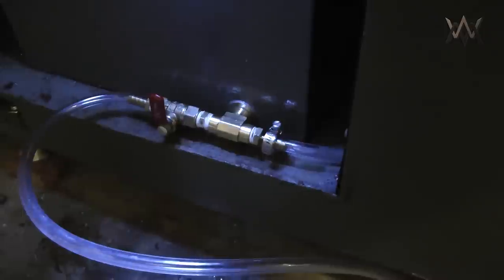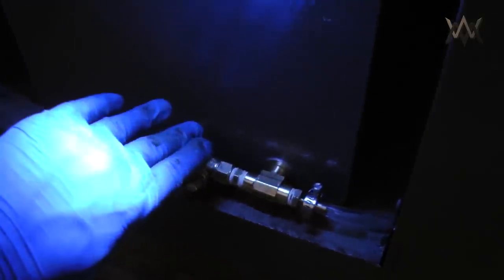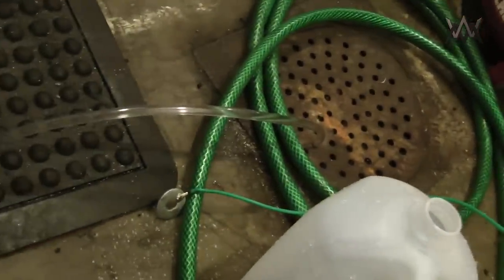I also installed that bar going across the chip tray just to help hold it better, and also kind of serve as a handle. So here it is after I got everything cleaned up. I filled it with tap water to calibrate the sight gauge, and I am about to drain it to test the drain valve and flush all the tap water back out, because I'm also switching coolant to Qualichem